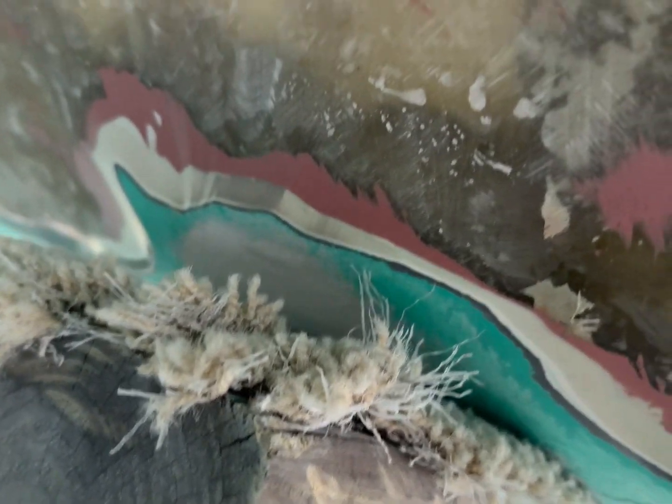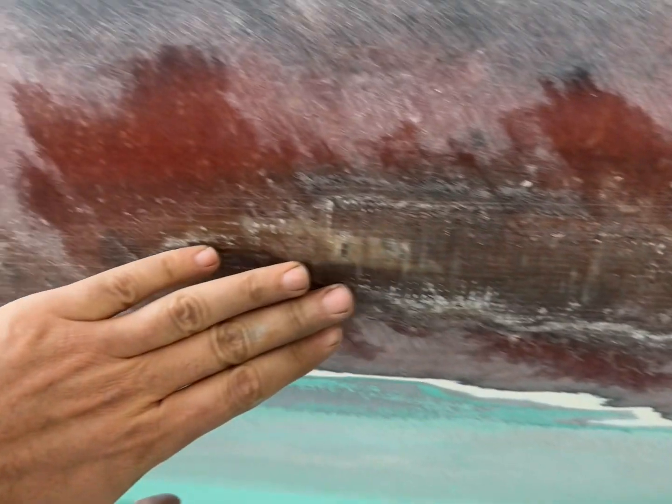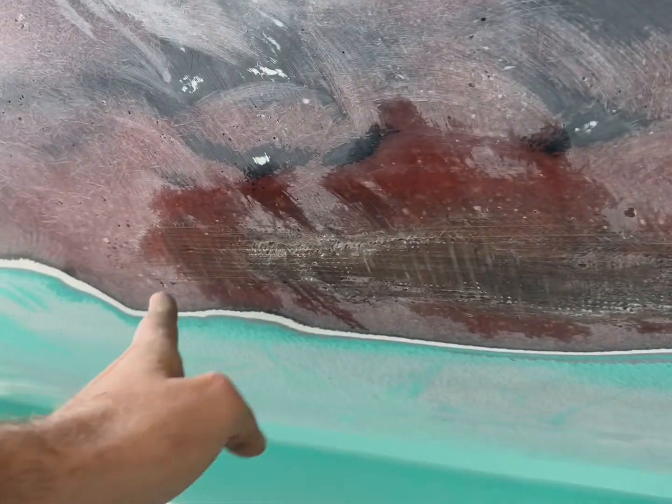And as we continued on, you can just see a tremendous amount of putty filler, just like you see right there. The thickness of that filler, body filler, is not meant for that application. And you can see old laminate that was just never ground away, to make way for new fiberglass to be laid up. And that's what we're discussing here.